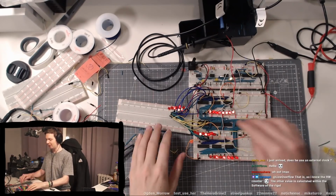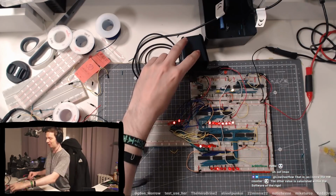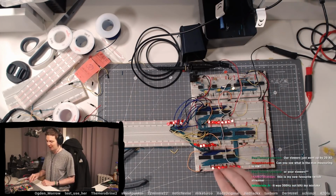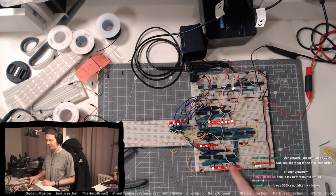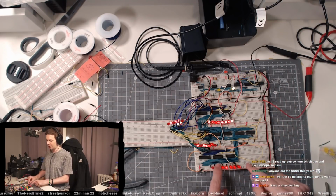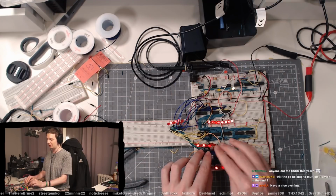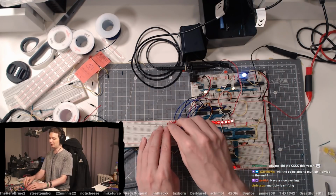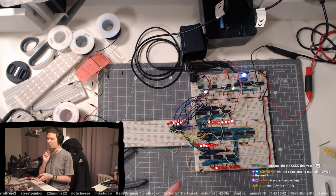And actually we are finishing up because we built this circuit today. We built the ALU. So let's just recap what we finished up today and then we wind down the stream. Basically a minus one. So if you do this plus this, this is basically like doing minus one of this value here. The register down here is reading the result back in. It will calculate the next result, which is automatically put here. And with the next clock cycle, it pulls in the next result. Effectively, with each clock pulse, doing a minus one, minus one, minus one, minus one, minus one.